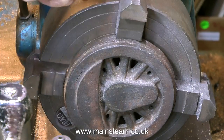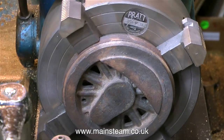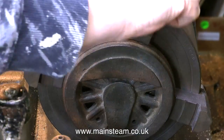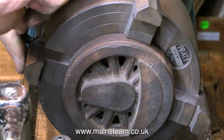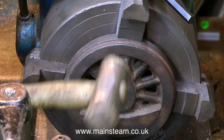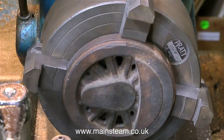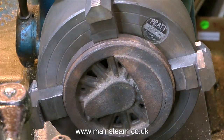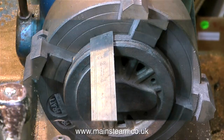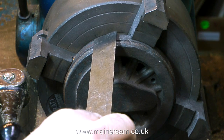Once the back of the wheel is machined I can turn it round in the chuck, and once again I'm spending a little time adjusting the chuck to make sure that the wheel runs true. To work successfully with an independent four-jaw chuck where each jaw is fully adjustable, if you're a beginner to lathe work you'll probably find that you will be adjusting the wrong jaw so the work moves in entirely the opposite direction to where you want it to go — it's very frustrating, but after a while you get the knack.